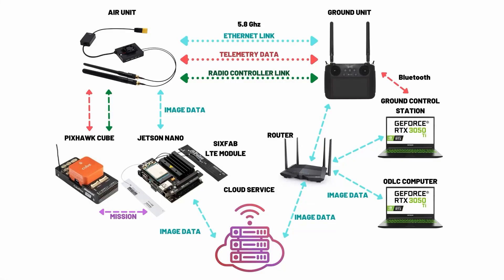For transmitting information required by the ground station, SIYI MK15 is preferred, providing stable and high-rate data transmission for a safe and successful mission. For transmitting images taken during surveying, cellular network communication is chosen as the main plan. A Quectel EC25 4G module is used to provide Jetson Nano with cellular network connectivity. As a backup plan, SIYI MK15 with SSH-based file transfer protocols over an Ethernet link is available.